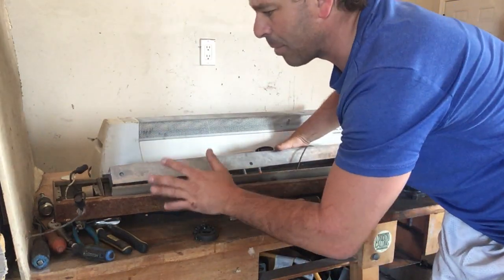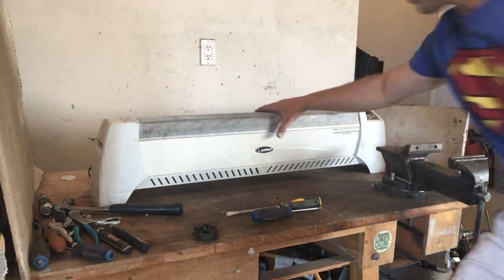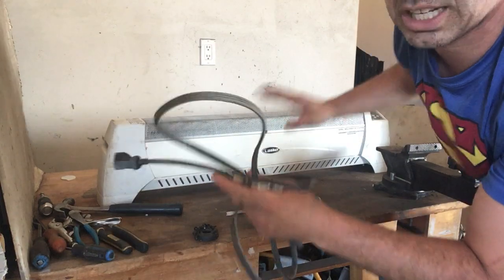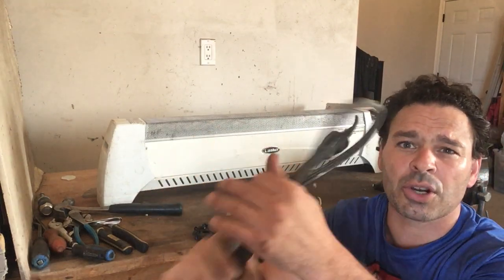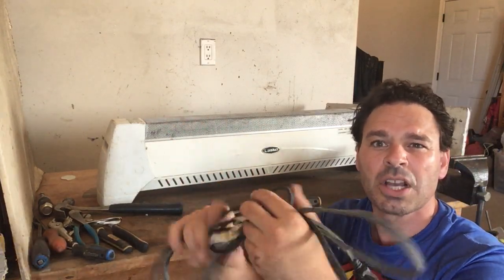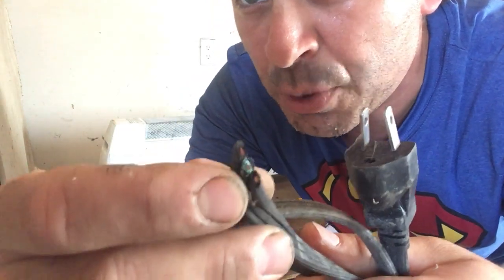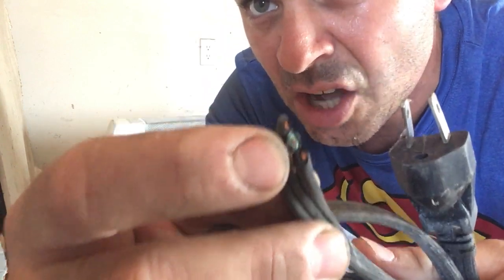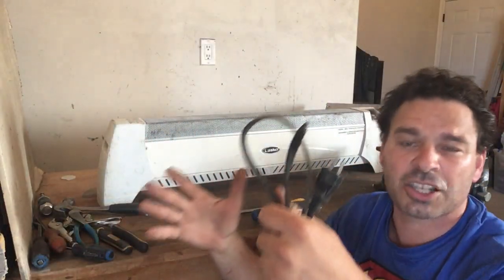I will include the link in my description to the full breakdown of one of these traditional baseboard heaters. This one is a little more modern — it's a stand-up type and it does have a really nice appliance cord. This right now is going as 40% appliance wire, currently going for $1.50 a pound Canadian in London, Ontario. The price just went up 5 cents — I just checked about 5 minutes ago. You can see inside it does have three cables, and the reason this is going to be 40% and not 60% is because that middle wire there does have extra coating on it.